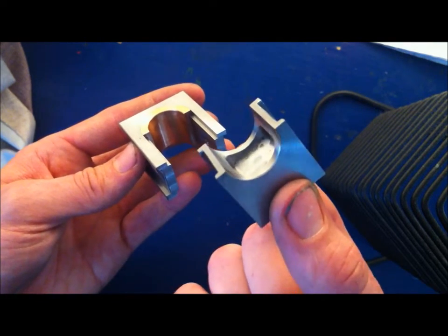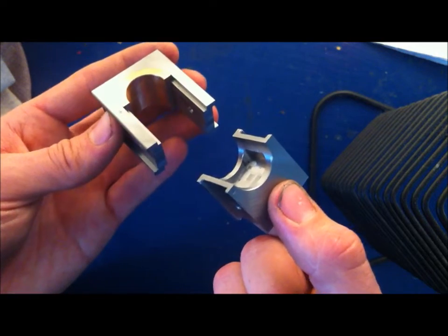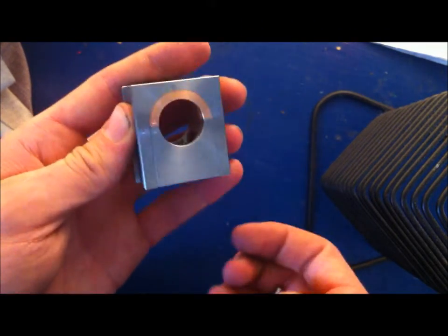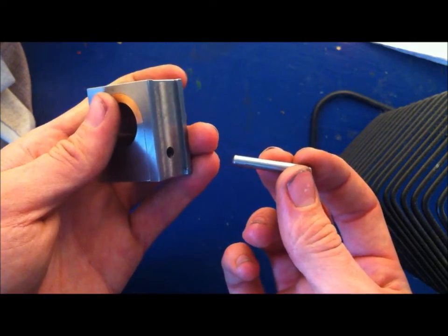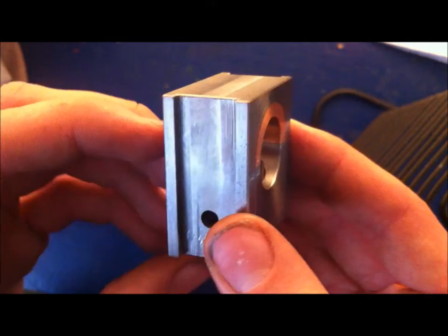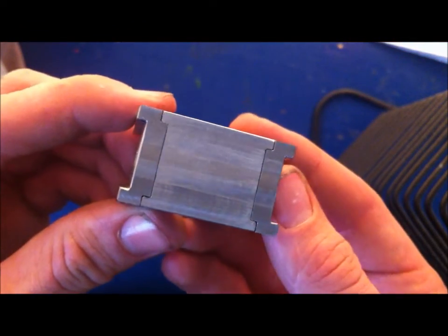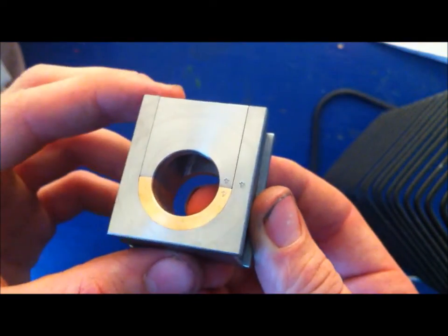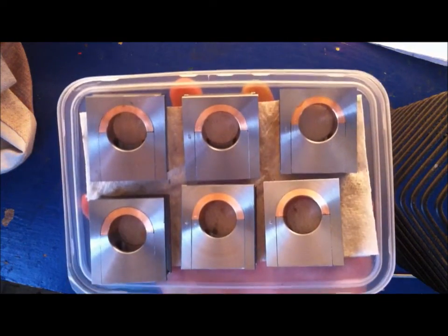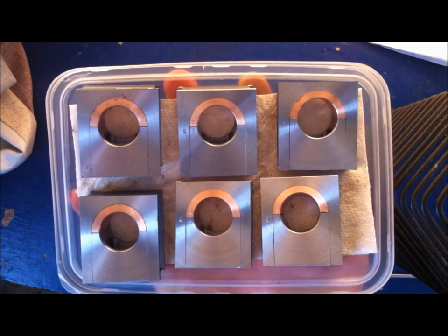You can see there's a cut-out in the bottom — that's an oil reservoir. A felt paddle goes in there, and oil fed up the ends of the axles will collect there and keep everything well lubricated. These slot in like that and a pin goes through the sides to hold it all together. There are in fact six of them, all here ready to be put into use. Still could do with a few rough edges taking off, but nothing out of the ordinary. Thanks for watching and see you on the next video.